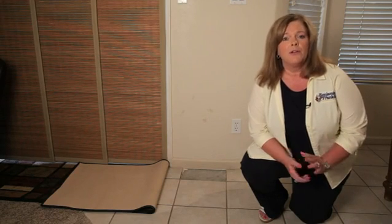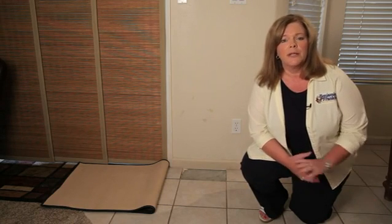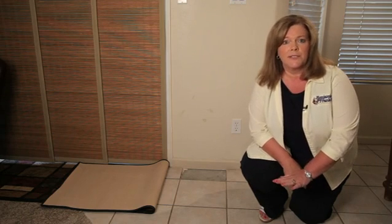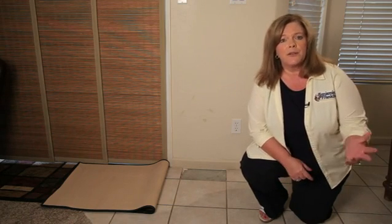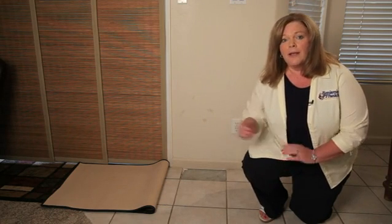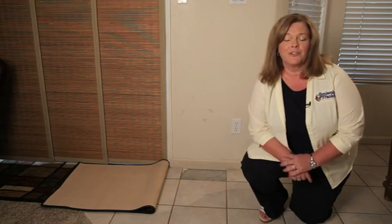From there, know if you've been running out of any hot water, and then look at all the floors. It's important to see if you have any warping, wetness, or hot spots to the touch. Here, we used all these techniques to find this slab leak underneath this floor. It can get complicated to fix, so I'd recommend that you use a local professional to make sure it's done